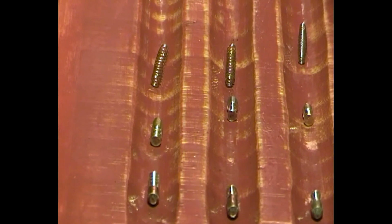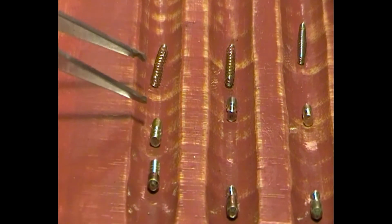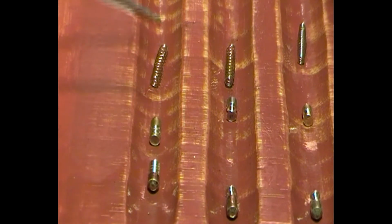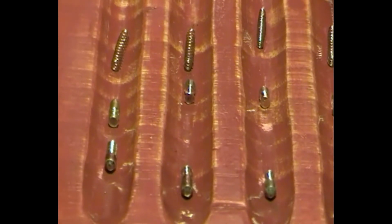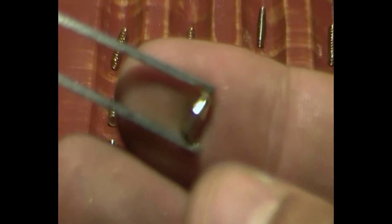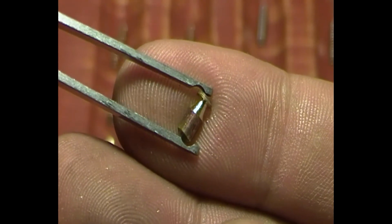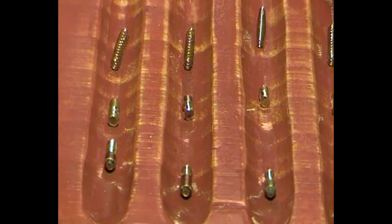Okay, so as it's written down on the piece of paper, the serrated at the front for pins 1, like the key pin and the driver pin. So I've got a homemade serrated pin here and another one at the top with the brass spring. Pin 2, I'll put the torpedo pin, so I made a torpedo style pin, nice sharp edge on that, and a spool for the top, a very fine sharp edge on that one. That also has the brass spring up the top. Number 3 is the spool at the bottom and the 2-piece spool at the top.